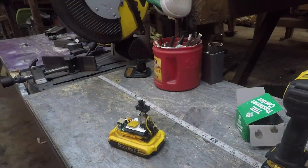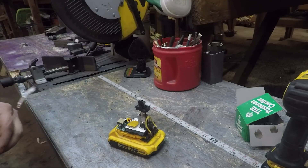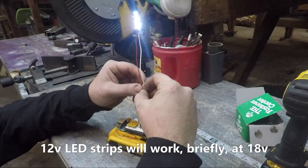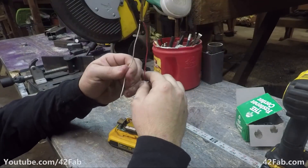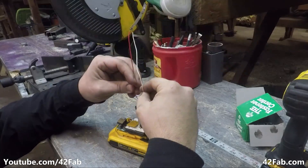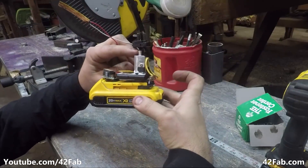After an exhaustive 30 second search in my shop I can't find one of my multimeters, so I've grabbed a piece of 12 volt LED strip lighting and we're going to test polarity this way. The front is positive — and just to confirm, plugging it in backwards gives no light. That tells us the front wire here is the positive wire, and that's also the wire that's insulated right there.